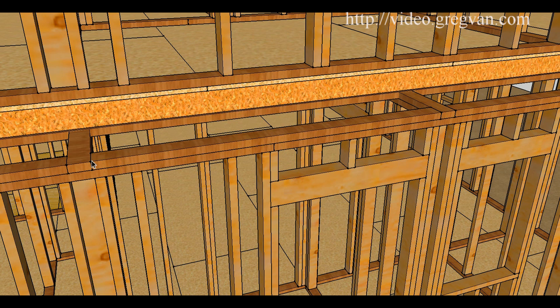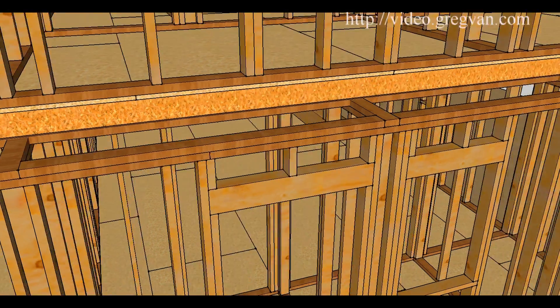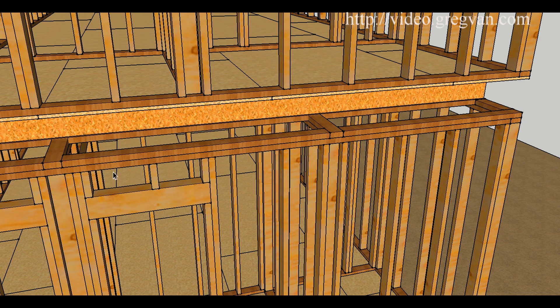As long as you have an eight-foot board here and the break is exactly in the middle of that board, you're not going to have a problem — that should be acceptable for a structural engineer. As long as we have a continuous plate, these breaks won't make a difference. The only time it's going to make a difference is if there is a break in the plate. The same thing is true on the top plate: if there's a break where the distance on the bottom plate between the top plate is less than four feet, you've got a problem.